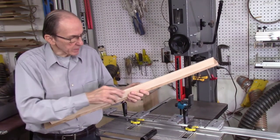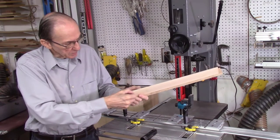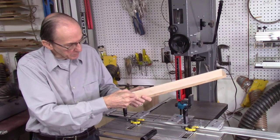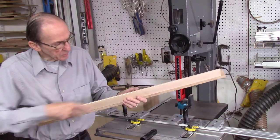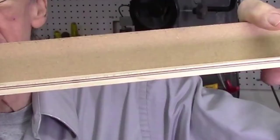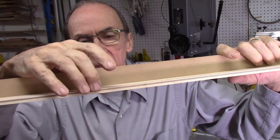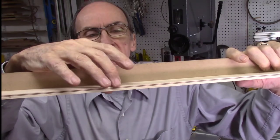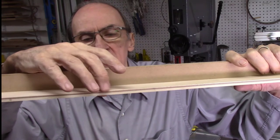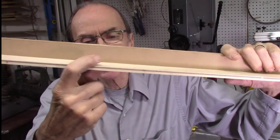This next board actually has four laminate layers. I have my piece of maple, about maybe 200 thousandths inch thick, and then there's a layer of padauk, and maple. So a total of five layers, four of those are laminate layers. And again, notice this is the sacrificial fence facing up. My laminate layers are on top. I don't want to be chipping those thin laminate layers out, so the blade will cut down and I'll get my fuzzy on the bottom, not on this top edge.